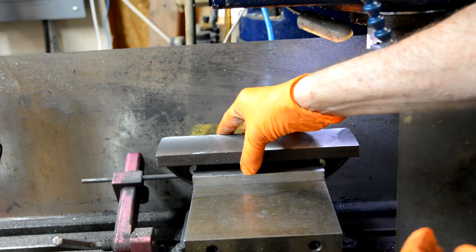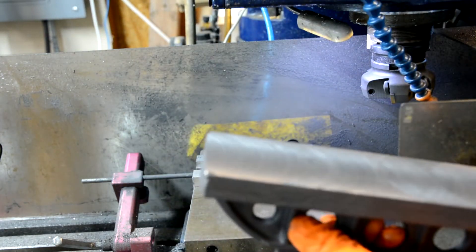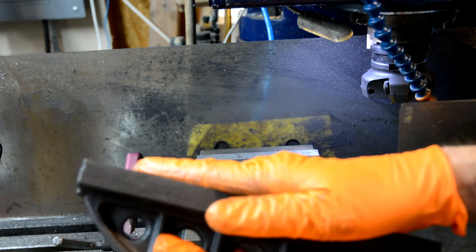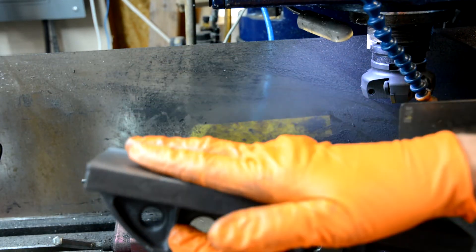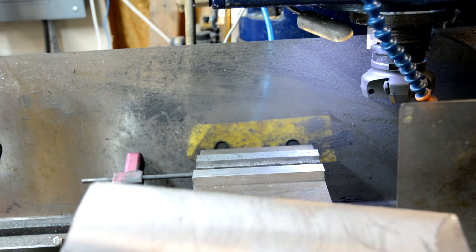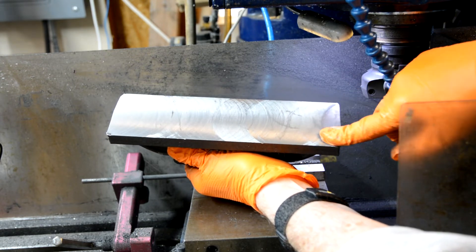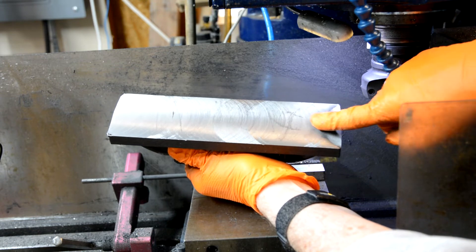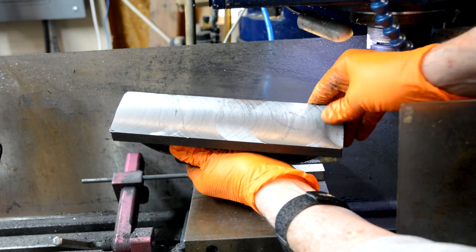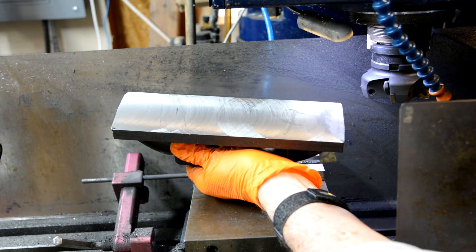I'm going to take it out and deburr it. One thing I can't see on camera, but this is pretty warm. After I get done doing the rest of it, I'm going to come back one more time and do the bottom, because that's causing quite a bit of warpage — that's why we're getting some of this pattern. You can see that's where it springs when it first comes up. There's a couple thou spring there. I don't have enough room to put a machinist clamp under it, so we'll take another pass when it cools down.